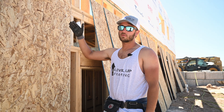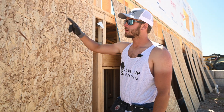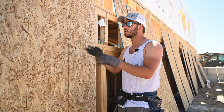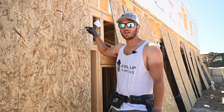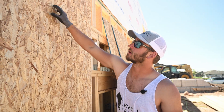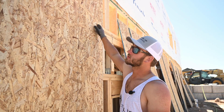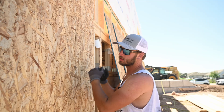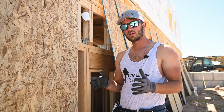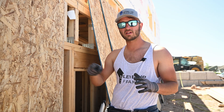As we nail this off, we have studs running up all the way through, but not through our floor section here. These trusses are 19-2 on center, which means you may have to pull your tape and mark it out, or you can make a mark on the concrete down below, just so you know where your floor trusses are in order to hit them with the nails. We're also going to do a row across this double top plate here and across this rim board up here. Ideally you want to tie in another row here on this bottom plate so that it ties in your bottom plate to the rim board, to the top plate, to the bottom plate. When nailing into treated, you want to use galvanized nails — this is a code requirement in our area, so we make sure we go around and do galvanized nails on the whole perimeter.